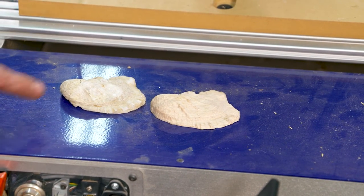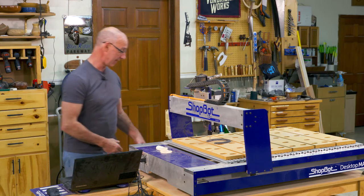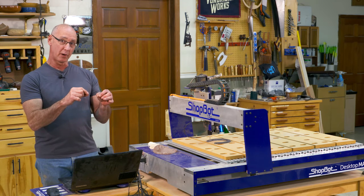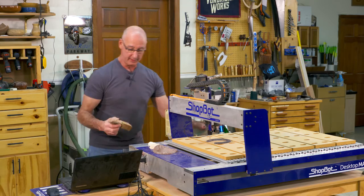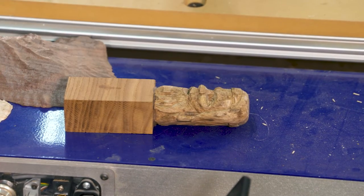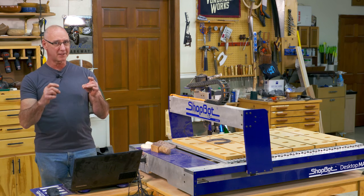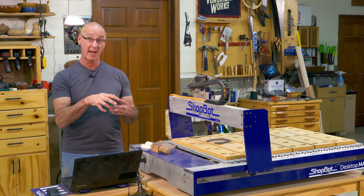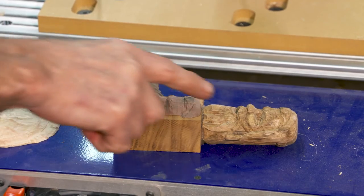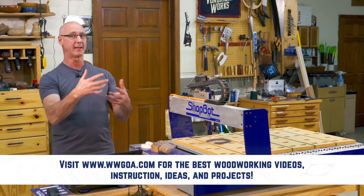And that's the one that I cut — that's in maple. Isn't that cool? Look at the reproduction between those two. One of the neat things about this is you're getting vectors, so if you want to scale them up, you can. There's that same shell cut in walnut. And here's my buddy George's carving — here's what I started with. A little bit of hot glue holding the carving onto the base so I could secure it with a clamp. Did some probing, then was able to cut that replication of it. The probe provides an amazing way to get really high quality duplicates of anything that you can fasten to the bed of the machine. You can probe the outside to get an outline, or completely 3D probe it to get the whole object. It's an amazing way to take advantage of work that's already been done and make it into something you can duplicate.